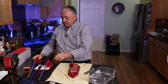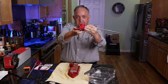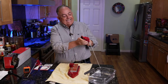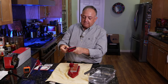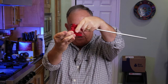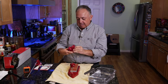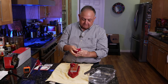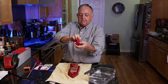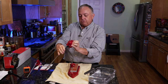The adjustable holder comes with its own rod, a magnet that holds anything on there, and it lets you adjust the knife angle on the side. To adjust it, you unscrew these — very easy to do by hand — and move this plate back and forth. There's a plastic adjustment that changes the angle from zero all the way to 30 degrees. It's clearly marked on the side in 10-degree increments. So I'm going to set this right between the 15 and the 20, tighten it up by hand — that's all you need — and now we're at 17 degrees.